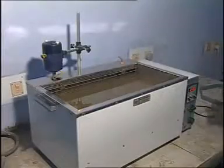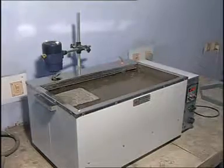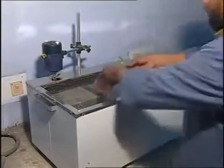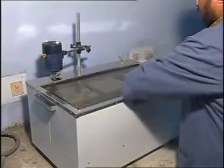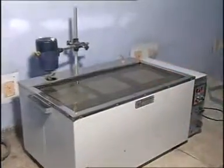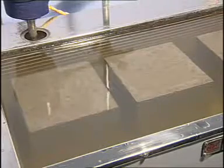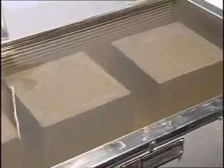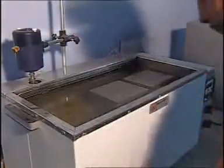The specimens are then kept submerged in clean fresh water at a temperature of 27 ± 2°C. The specimens are kept in water either for seven days or 28 days. Water in which specimens are submerged should be renewed after every seven days. Specimens when received dry should be kept in water for 24 hours before testing. The cubes are taken out of the tank just half an hour prior to the test.